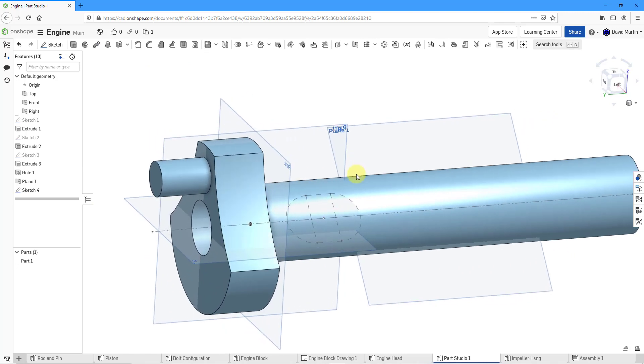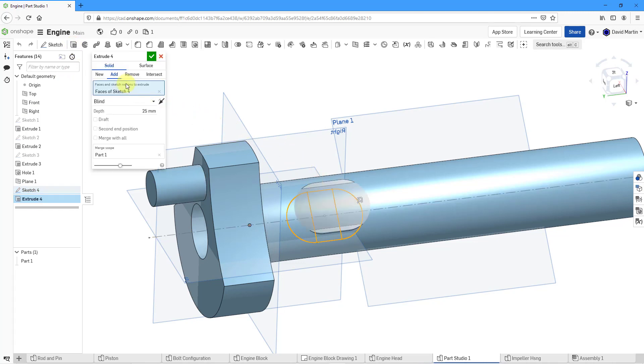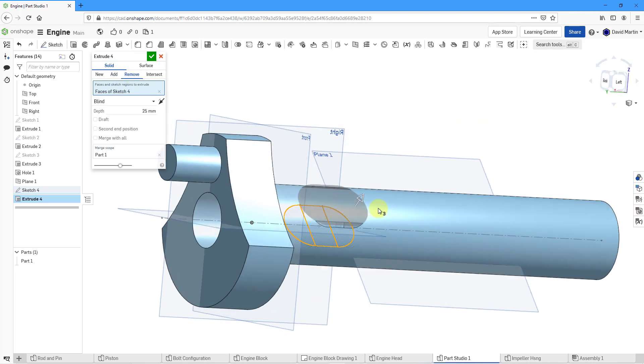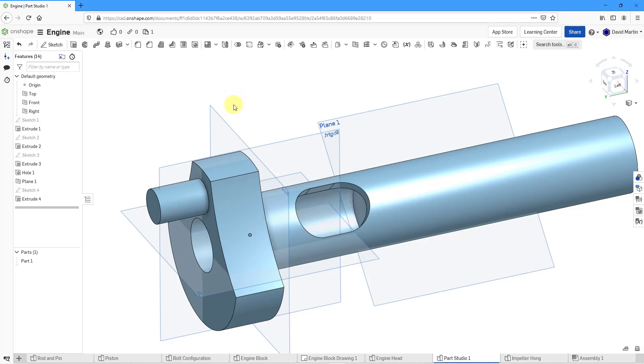The sketch right now is in the middle of the model. I'm going to select the sketch and then hit the extrude tool. Right now it wants to add material — let's go to remove material. It went in the wrong direction, so let's flip the direction. Right now it's using a blind depth — I can go to the drop-down list and change this to through all. Now it is penetrating through the model just the way that I want it to be. That looks good. Let's hit the check mark to complete that one.